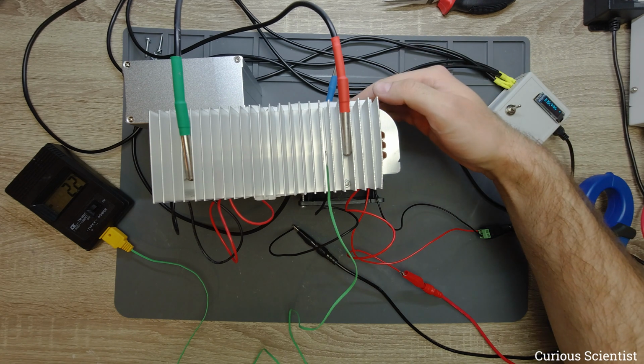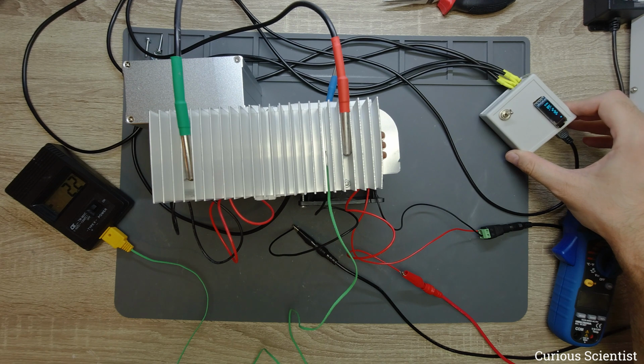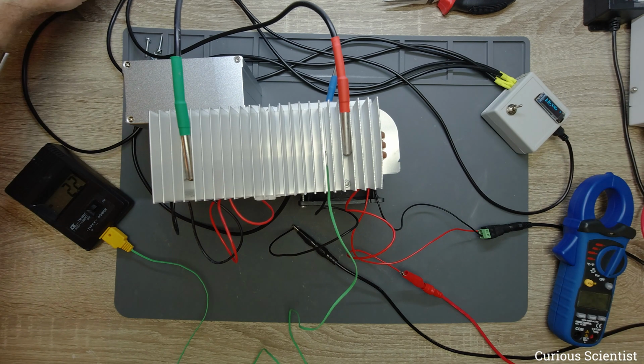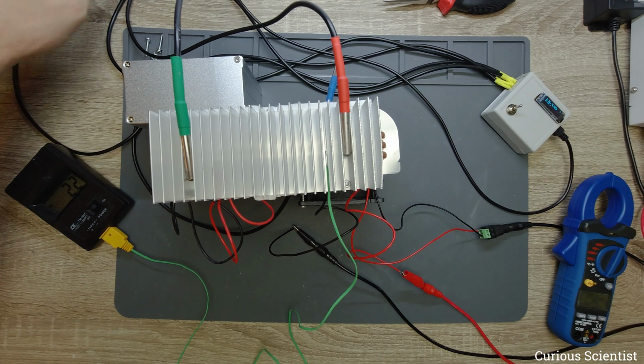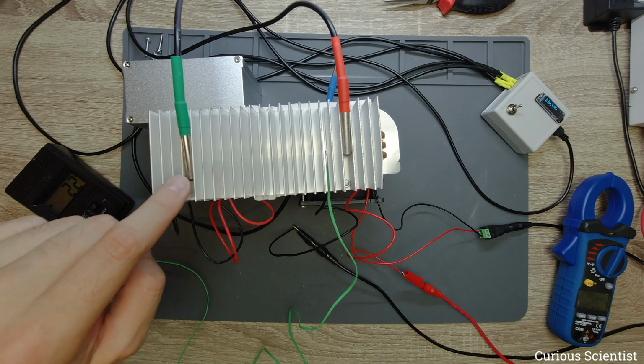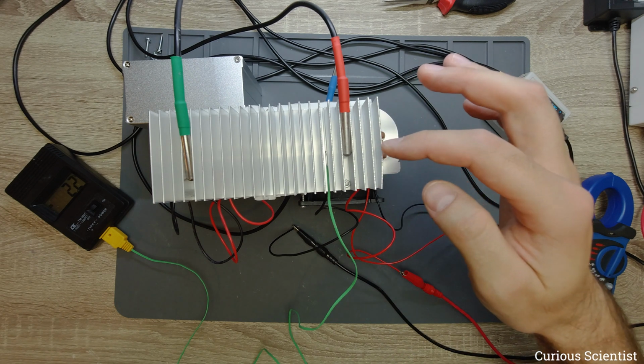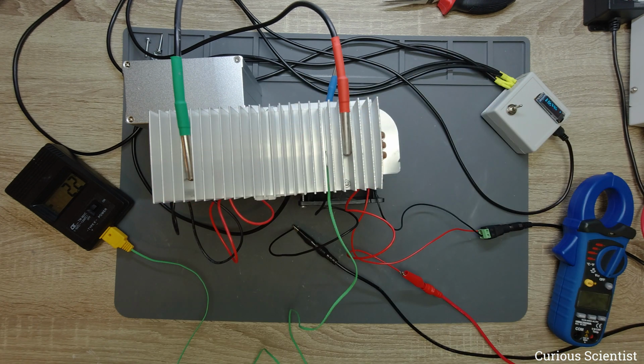And the air exiting here is now 29.7 degrees. Of course the room temperature went up a little bit, because the air behind this is being measured. And this is 21.7 degrees Celsius. So there is a small thermal heat transfer in this direction.